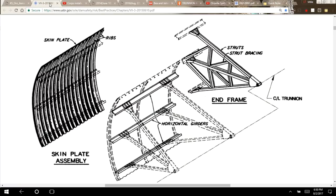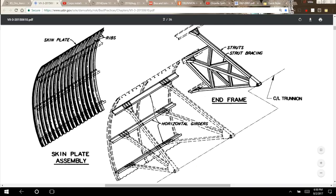To show you how the gates look, this is a diagram of a tainter gate. You can see it's basically an assembly with horizontal girders and an end frame with struts that converge in a trunnion joint. A trunnion joint allows them to pivot — it's a pivot joint — and there's one on each end forming the arms. This is the skin plate that goes over the front. These gates operate in a semicircle, going up and down, and their actual weight helps them to go down.